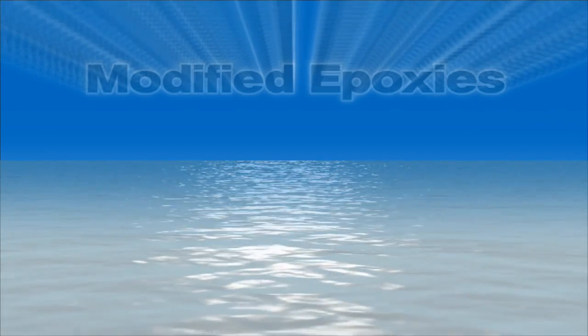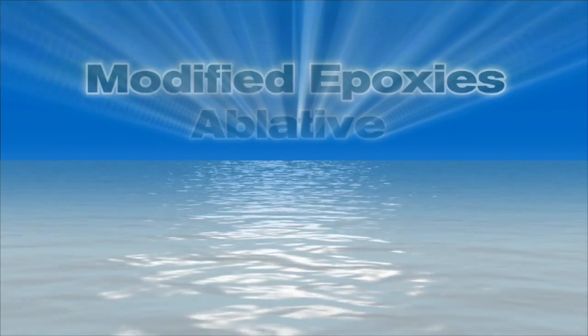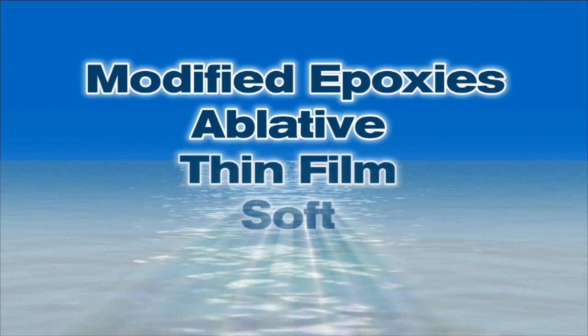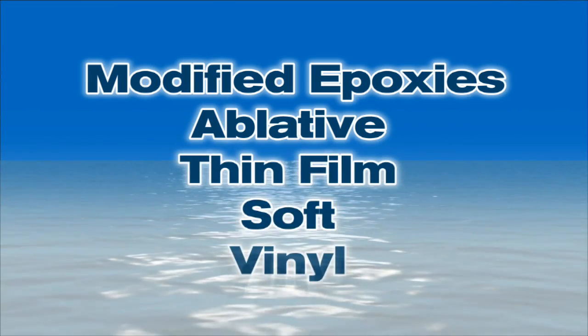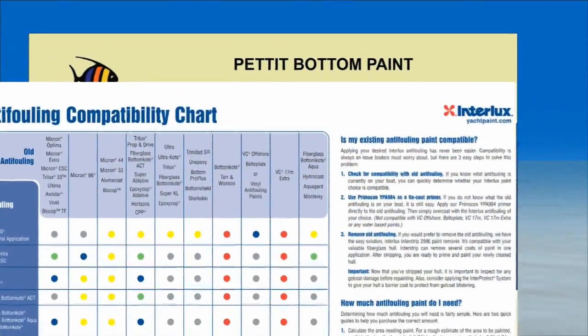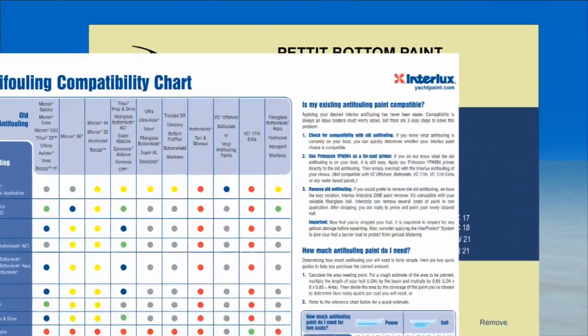There are 5 primary types of anti-fouling paints. Pay attention, as there are pros and cons to each of them, so choosing the one that best fits your type of boating and works well in your area is important. You must also consider the compatibility with any existing bottom paint you'll be painting over. Generally, softer paints can be applied over harder paints, but not vice versa. There are exceptions, however, as it's always best to consult a compatibility chart.